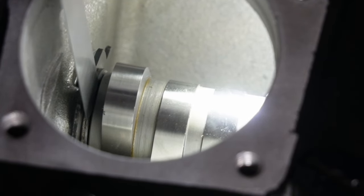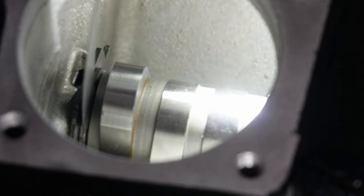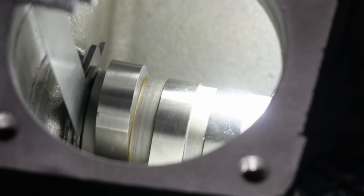This is where we're shooting for — in between the end of the cam and this little washer. I can just slip that down in there: 15 thousandths of an inch just in between them, but that's showing you where the space is in there, and that's what we're shooting for.